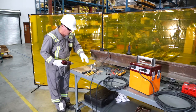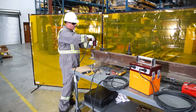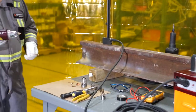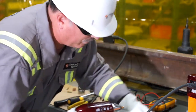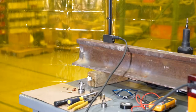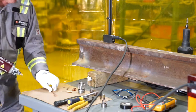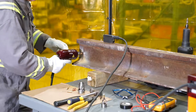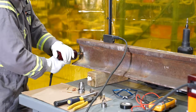Take the rail bond. One last double check to make sure you're properly set — look at the top of the collar via the ejection button. Double check that connections are tight. Take the gun with two hands, press down to depress the spring in the middle of the gun, put your second hand on top of the gun, look away, then hit the trigger and fire the shot.